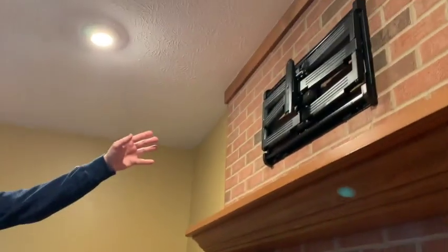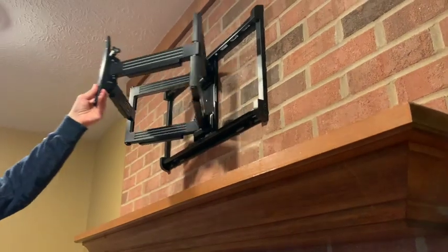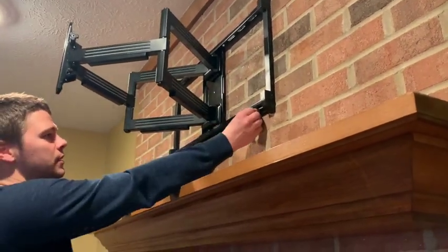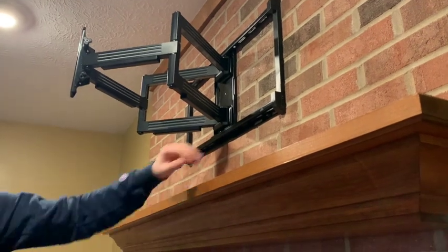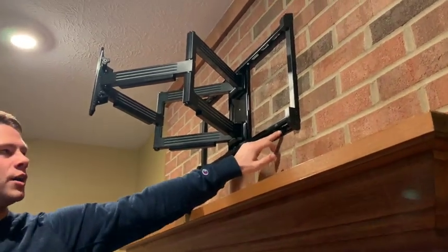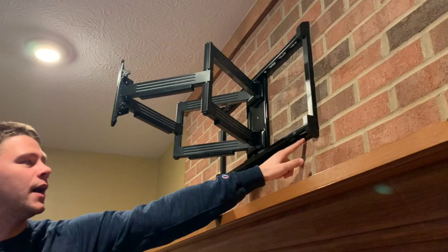Okay, so it's been probably about 13 hours since we actually put everything in. So everything's exactly as it should be. These bolts are still really tight. I just torque checked all of them. So we get plenty of time for the concrete caulk to cure in the little cavity behind these lag bolts here.